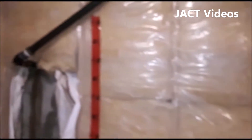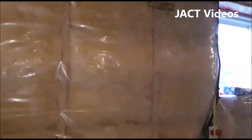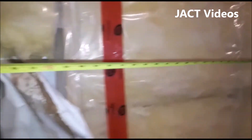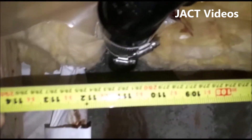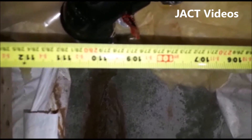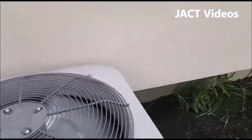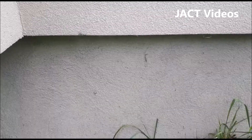I have no choice but to go outside and dig the dirt out from the area where the pipe exits the house to find the problem. To find out the exact spot to dig outside, I measured the distance from the nearby window to the drain pipe hole to find out the exact location of the pipe. Now let's go outside and figure out the exact location and start digging. I put a black mark on the wall after measuring outside where the pipe is buried under the ground.